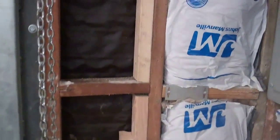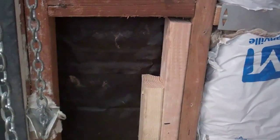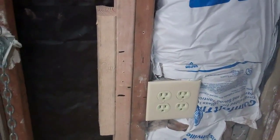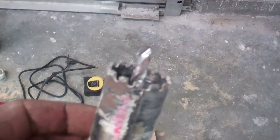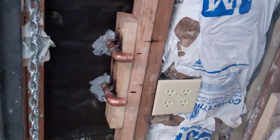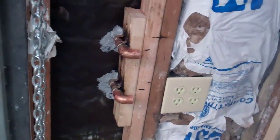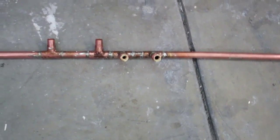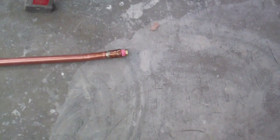I'm just starting to do the airlines. It's going to have quick couplers on the outside of the garage and some on the inside. I needed to space that away from the plug socket so I screwed 2x4s in. To drill through the stucco you use one of these hole saws with grit on it. I got the two pieces in that go through the wall for the two quick couplers on the outside, and there's going to be two quick couplers on the inside as well, with a quarter-inch ball valve on the bottom to drain water.